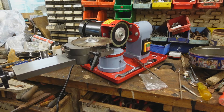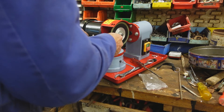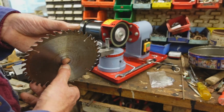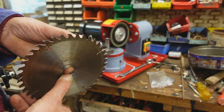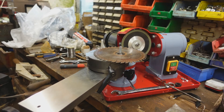Well, I got around the whole blade astonishingly quickly. Now I think the tops of the teeth need doing. I'm doing the tops alternately because that's the way they were sharpened from new. I've set the thing up here to about 10 degrees, which seems to be what they were set to to begin with, so let's have a see.